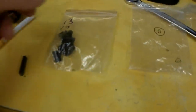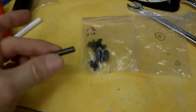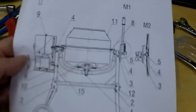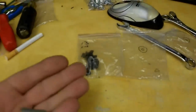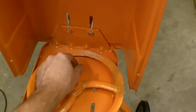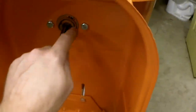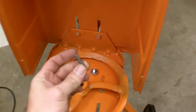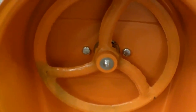Out of bag 13/14, there's a small key that needs to go into the pulley key slot — I don't believe the manual makes any reference to this key, but you'll need it. I'm putting a few drops of light oil on the shaft to lubricate it for pulley installation, then lining up the key, sliding everything together, and tightening it up. That was quite uneventful — went on just like it's supposed to.